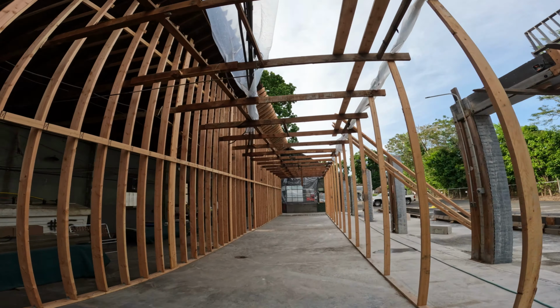So we got this ridge board up. 3 24 footers are in place right now, and those things are heavy as hell. It's 14 inch LVL. LVLs are usually 1 3/4 inches thick, and these things are heavy. We were able to use the lift to do the last one over here, but since this dumpster is right in front of that one, the second one, we couldn't get up there, and the first one we just tried without it, and it was a real pain, but the lift makes it a lot easier.